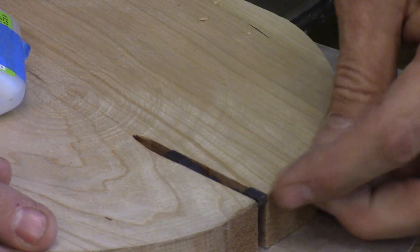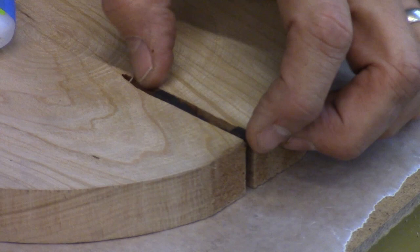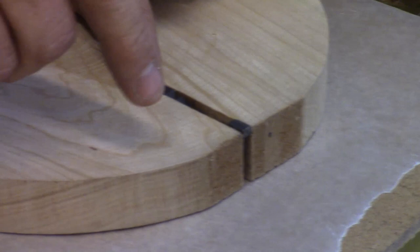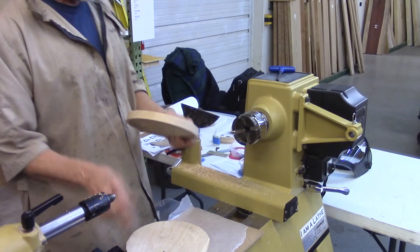I want that to go in here just like so. The trunk is on the — okay, we skipped a step. I'm going to continue talking and then go back and do the step I skipped. This is not the same — I didn't true up the outside edge of this, and that's important because the tree registers on that outside edge. So I'm going to glue this in after I true up the outside edge, with the outside of the trunk on the outside of the ring, and flush with this flat spot I've made here.